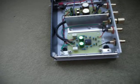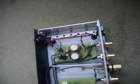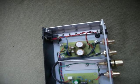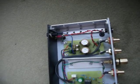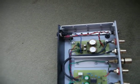I've given it lots of headroom because I've used a plus/minus 15 volt power supply, so I really wanted to avoid distortion especially. And I wanted a good transient response too, so I could get the best out of my 78s.